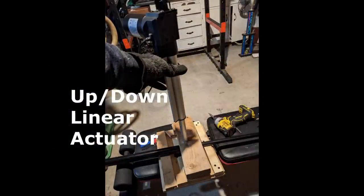Last step in the control arm assembly: you need to put a 2x4 across that wooden bracket to hold up the 30-inch linear actuator, then drill a hole and pin in your final linear actuator. This is called, creatively, the up-down linear actuator, since it lifts the whole lens assembly up and down. Your control arm is now complete.